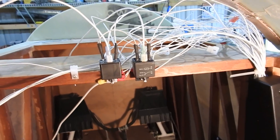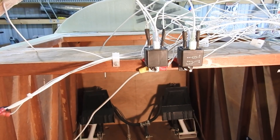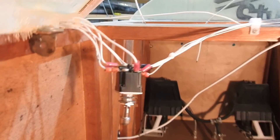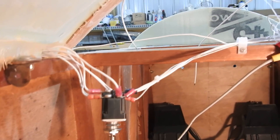The fuel pumps will all go through that as well. That cable hanging right there is the ground that will attach to the tank for the ground for the fuel pumps and the ground for the sending unit. That's my new switch — I pulled off the panel and wired in there. Once the panel goes in, it will be done.